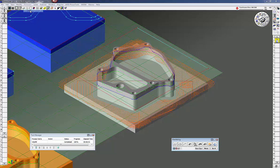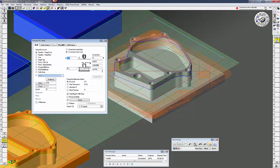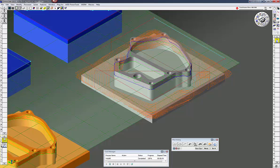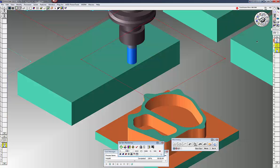Next I'll bring in the process to cut inside the cavity. Some customers want to plunge in with a drill first — that's faster — and then go inside that hole with the end mill to cut out the pocket. To do that you need multiple processes. The first process is a drill, staying about five thousandths off the floor of these cavities. Make sure you check the box that says pre-mill because we're drilling before milling, and put a check in the entry box. Then add your volume mill wireframe process with the depth. Click on your two cavities and click do it.